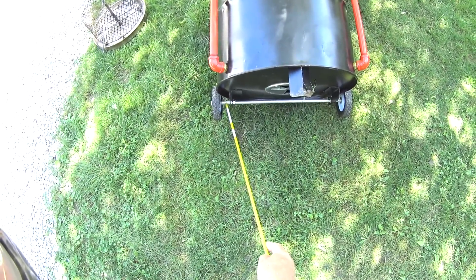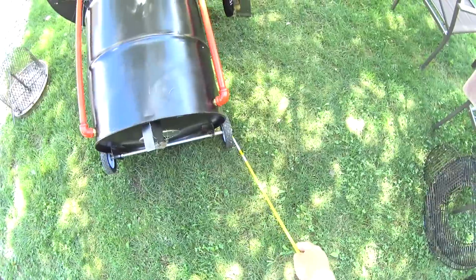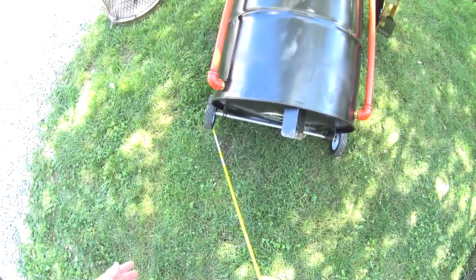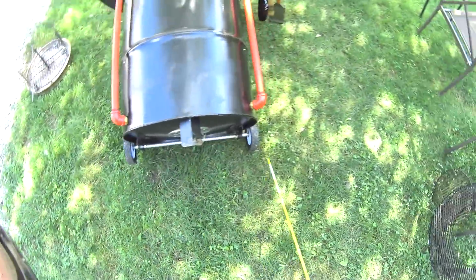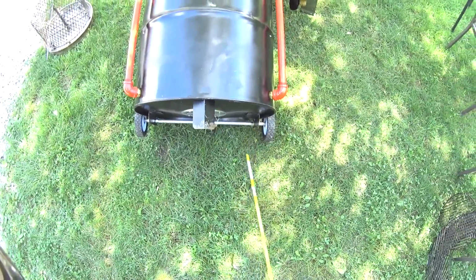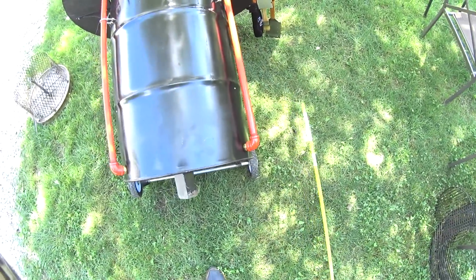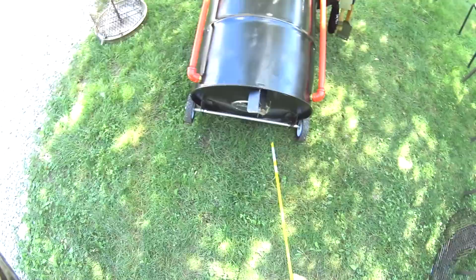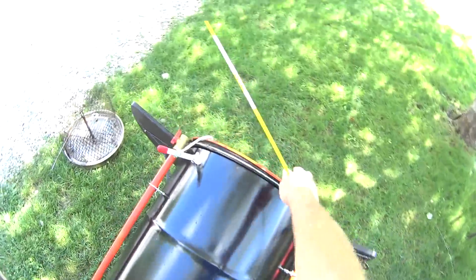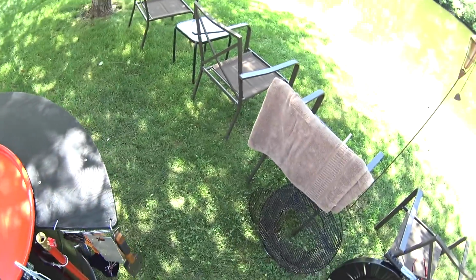And then I have this aluminum tubing that I used as spacers. Once you put the nut on here, and you've got your bar clamp on here, you can bolt it all together, and basically this all thread with these two nuts on the side ends will keep these two brackets parallel, so you don't have that weird looking wheel sensation. So that's basically how the axle is configured. Just drill a hole in both of these and run the rod through. That really helped with the air flow.